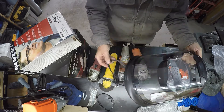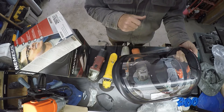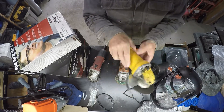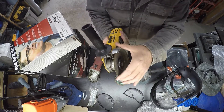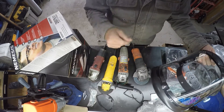Do you wear safety glasses inside this face shield when grinding? Is this face shield ballistic? No. Is it going to keep you from sparks? Yes. But is it going to keep you from a cutting disc spinning at 12,000 RPM? Most grinder discs are rated for 12,500 or 13,000 RPM. That's freaking fast, and it can cause damage immediately if that wheel comes apart.